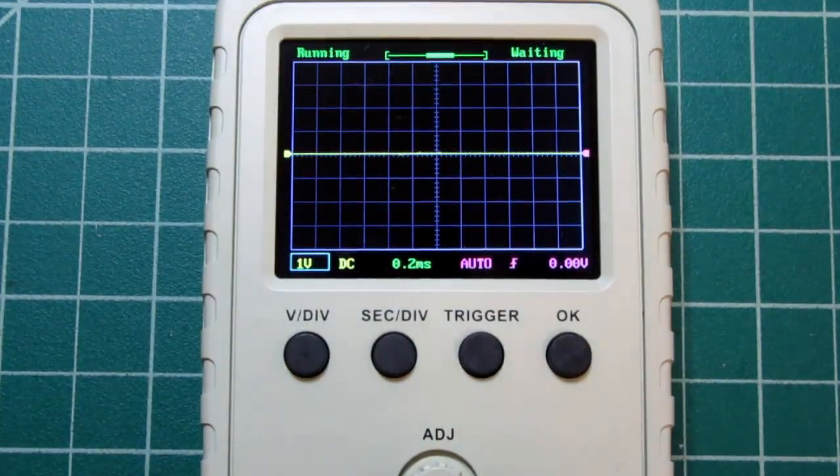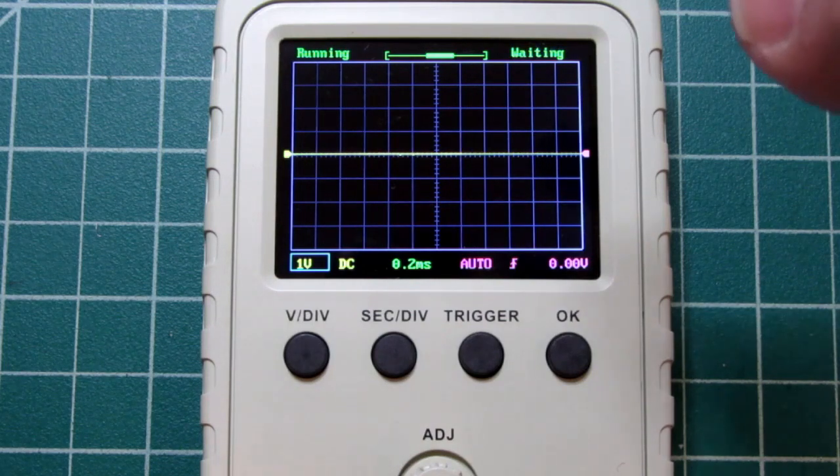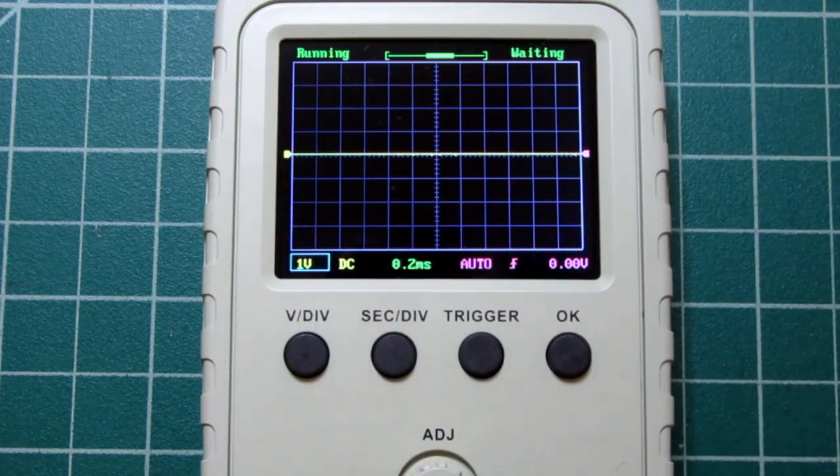You should always use a scope in DC mode as your first default. That allows you to see the true signal, not just the AC component of the signal, and normally that's what you want. But there are times when you don't want to look at the DC component — you just want to look at the part that's alternating, the AC component — in which case you would use AC coupling, and it strips out any DC portion and just shows you the AC part. Normally you'd want it in the DC position, or in ground if you just want to verify where ground is. This pointer should tell you that for most situations without having to constantly go back and forth like you would on an analog scope re-verifying your zero volt level.